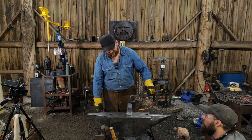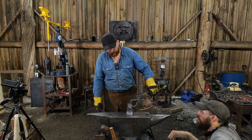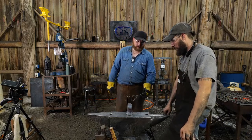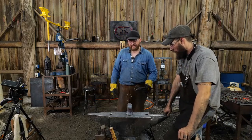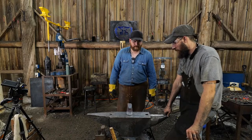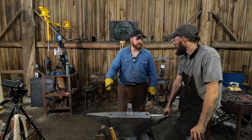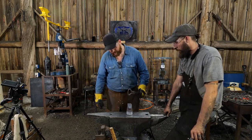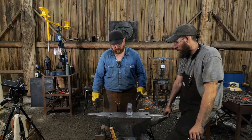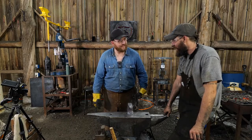We're going to draw these out the next stream we do. Next live stream, we'll actually draw this material out into horns and finish out the horns. We'll probably stamp it and touch mark it, all that jazz, or grind it and then heat treat it with our touch marks on it, and send her on down the road as the 500,000 subscriber anvil. We'll make sure to stamp this one with the 500,000 before we heat treat.